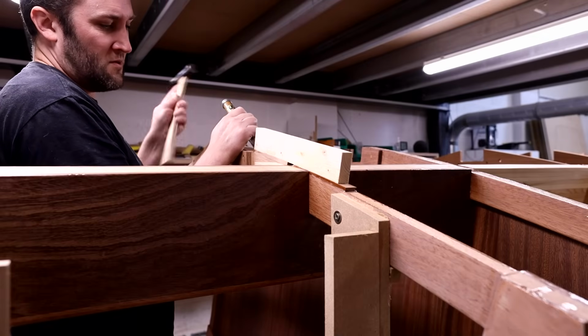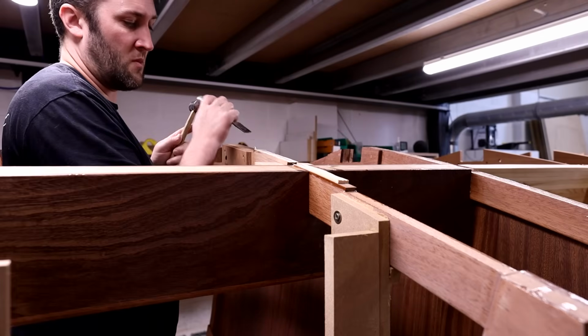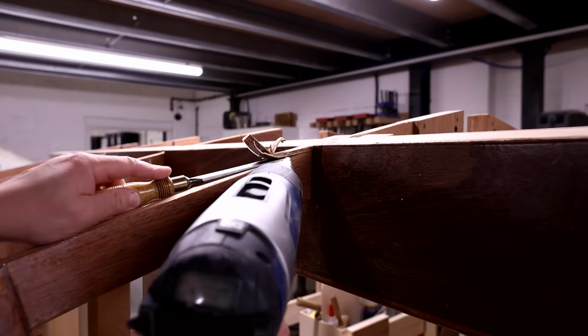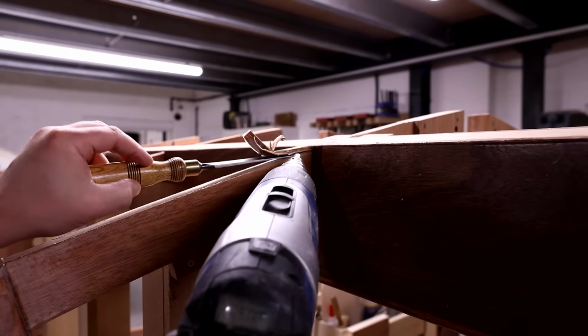Once that middle section is bonded in place, the temporary bridge parts that maintain that continuity between the frame can be removed, and then we get back to just the existing framework, which is going to help us to form the bottom planking very nicely.